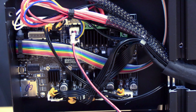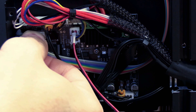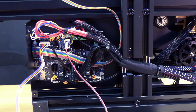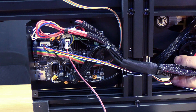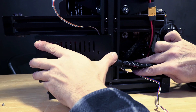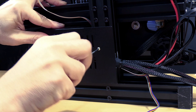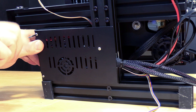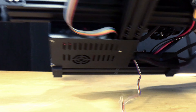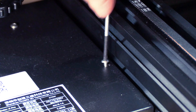Don't be afraid — we are only looking for one connection and it's right there. We are simply going to face the clip down and pop it in. When it comes to cable management, everybody has their own way. However, for this part, take this wire and feed it through this pre-existing gap in the frame to position the cable neatly toward the back of the machine where you will run it to the probe. Now you can put this cover back on and put the screws back that you removed earlier. Remember: the long one goes in the back and the short ones go in the front.